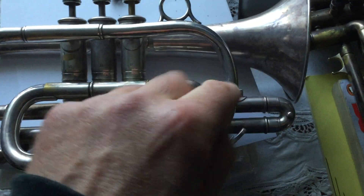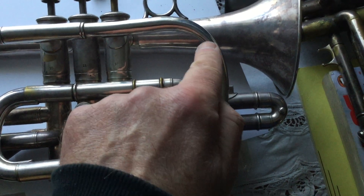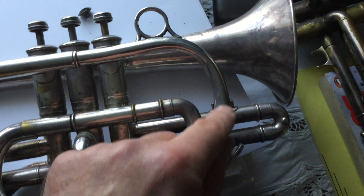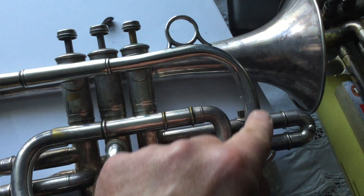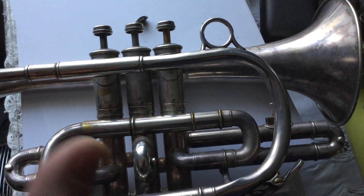Slightly smaller balls are inserted progressively as we go around. They go down in gradations of a tenth of a millimeter, because it's a very shallow taper. But basically, that's what it entails. I'll load this up to YouTube and send you a link — it's actually quite a lot of work, I'm afraid.